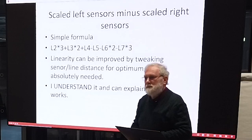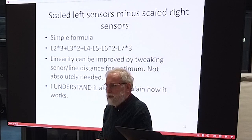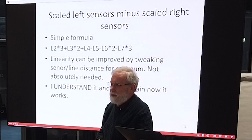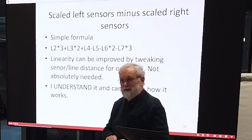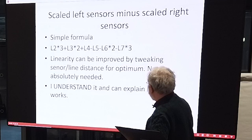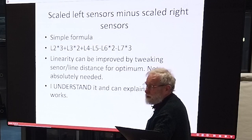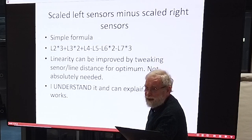How much impact does the spacing between the sensors have? There's 10mm spacing between sensors. If the spacing were different it could affect things — you've got a possible problem with gaps between sensors and the jiggles between sensor overlaps could be worse; you want them to be matched. Crucially, the formula has no divisions — anything can be zero and it doesn't matter. It's not necessarily a better algorithm, it's just a simpler algorithm, easier to understand. It's what the kids use, and they got quite quick by the time they came here.